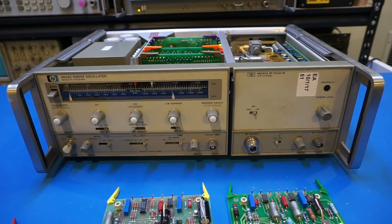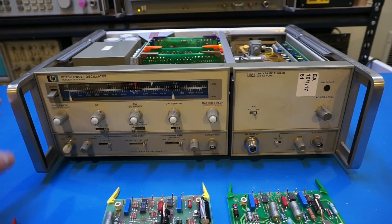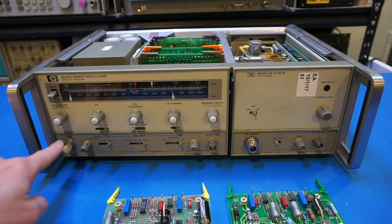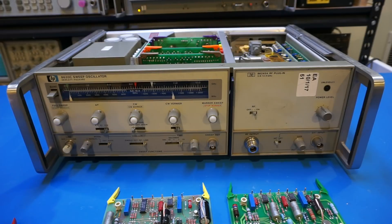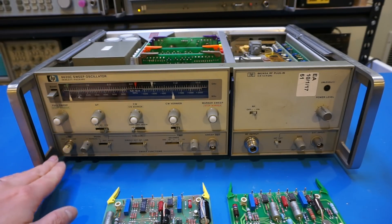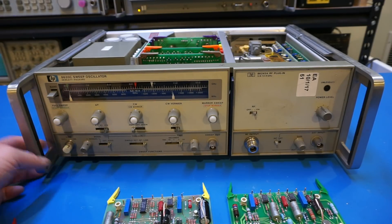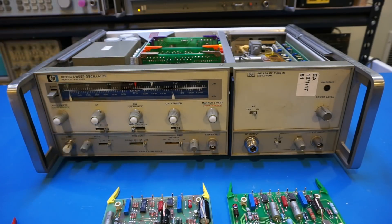The second part of the problem was that when I pressed the switch nothing happened. I had a meter measuring the power entry portion of the circuit — given the mechanical construction of this type of equipment it has a mechanical connection for the primary — so I should be able to measure the primary winding of the transformer, but I wasn't able to get any reading. So clearly something was wrong with this switch or some related circuit.